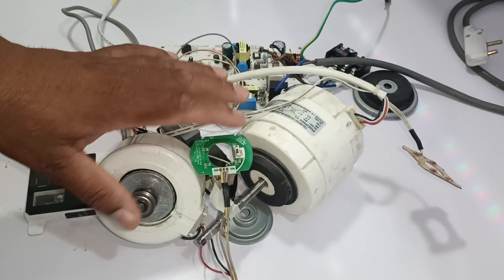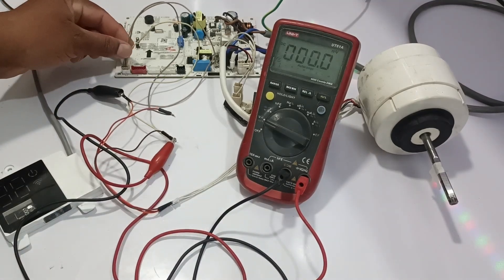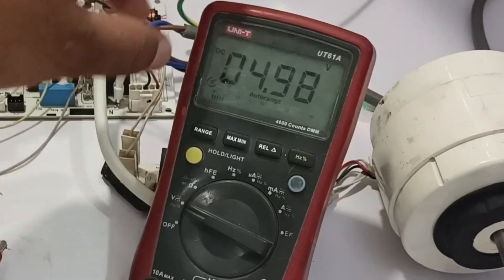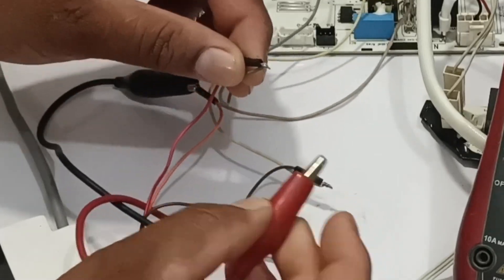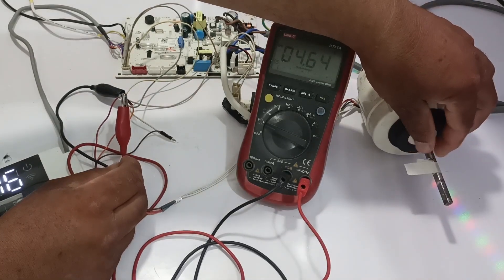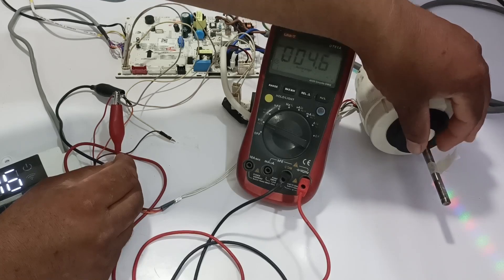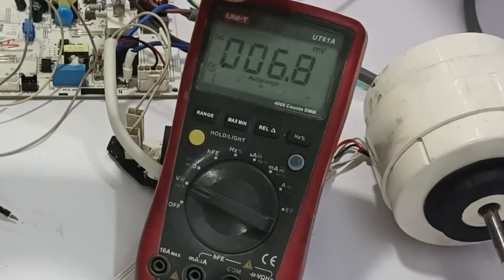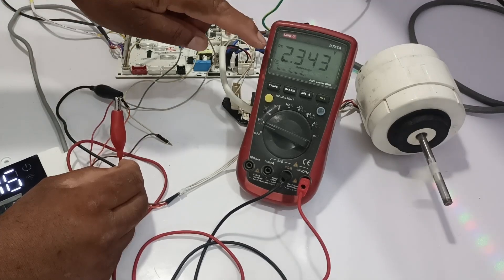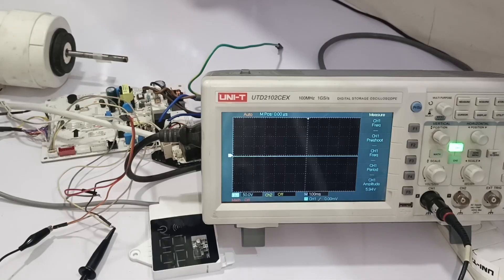I will check why both motors are compatible on this circuit board but not the other one, by checking how many voltages are coming out from the circuit board and how much voltage the feedback sends back. At input, 5 volts are passing. I will put this clip on the feedback wire while the motor starts. The motor is not working. 4.62 volts are still passing through the feedback wire. If I rotate the shaft of the motor, these voltages will not be shown. The voltages are finished at a point according to the motor's shaft position because the hall sensor has stopped working. The feedback is giving 2.3 volts on the multimeter and the line beneath the multimeter also fluctuates. I will analyze it further using an oscilloscope.